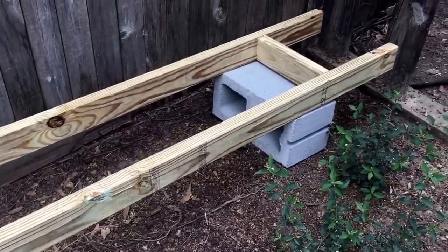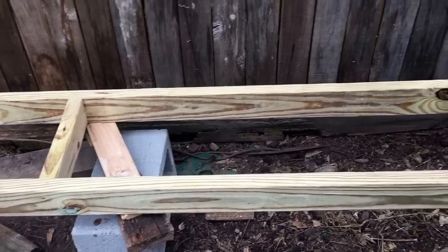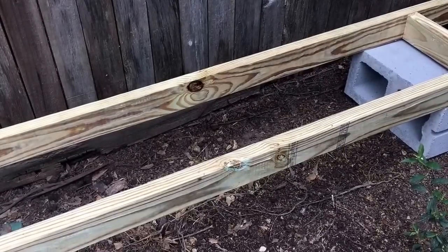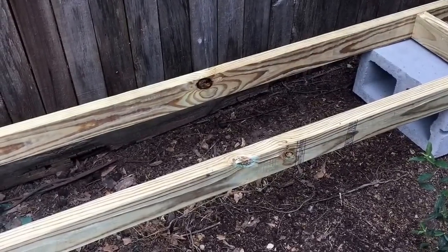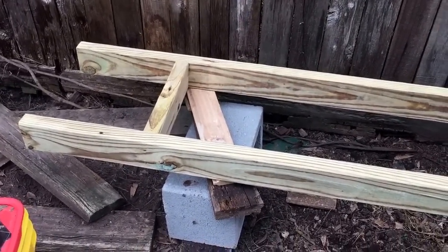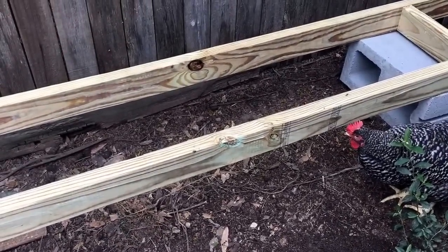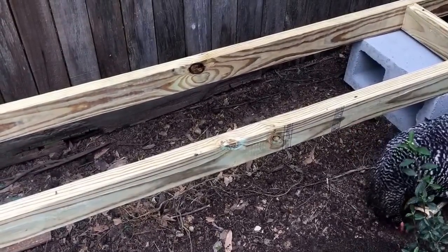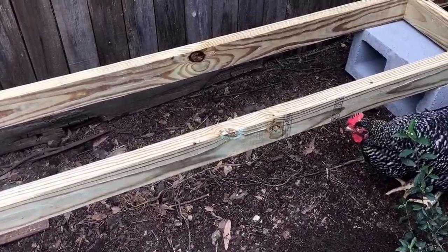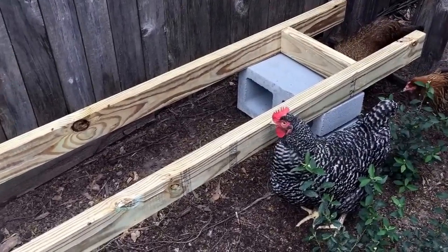Two 2x4s, eight feet long, and on either end a foot in from the end I put a one-foot cross brace. Does it have to be exactly a foot in? No. Could I put one in the middle? Yeah, probably, but I don't think it's really necessary. I was going to put them immediately on the exact end but I thought over time this middle span might want to bow out a little bit. It's not really going to have any force on it to make it want to bow to the outside — all the weight is pushing down. By moving my cross braces in a foot, that should help prevent that at least a little bit.